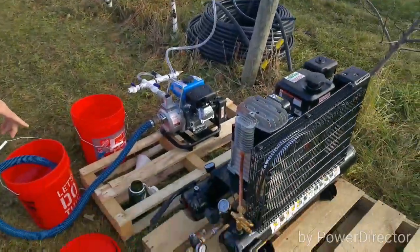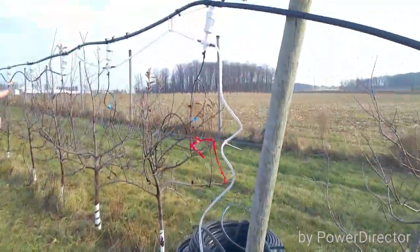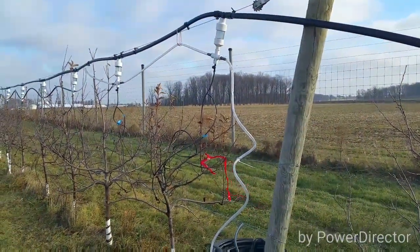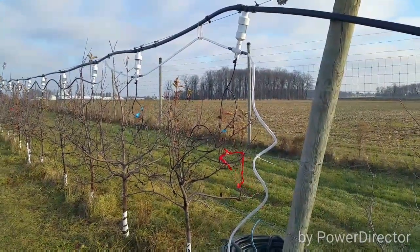The compressor is set at 45 PSI to allow it to go over the 35 PSI barrier for the blow-off valves, and that'll evacuate the system once we open that valve.